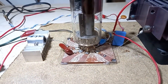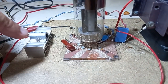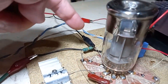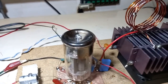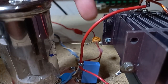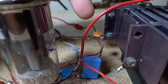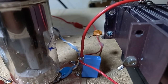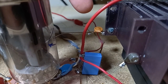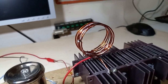There are two polypropylene capacitors here and here — these are for the supply voltage bypass and the grid tube bypass. Then there is a simple 68k resistor for the grid leak of grid 1. This capacitor here comes from the antenna input of black and white vintage TVs. It's fairly high voltage, 470 picofarads, and this is for the feedback of the oscillator.